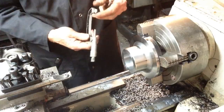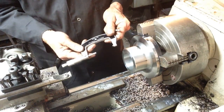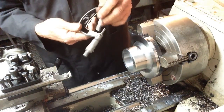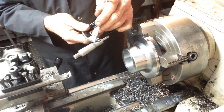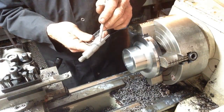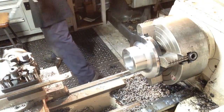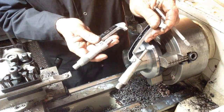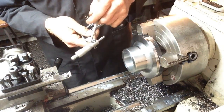These are micrometers I've had since my apprentice days. They're Japanese made ones. Uchida is the brand, U-C-H-I-D-A, and they've been very good. I just don't like how, I'll show you one day, I'll get a close up. The half millimeter divisions are on the same side of the thimble as the divisions, but I've had to do that because it's got microns on it as well. But saying that, yeah, that's why they've done it. I thought this one had microns on it too, but that's the reason. Just to have the room.